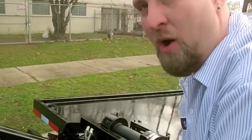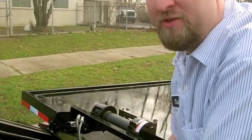You loosen the pulleys up, get the adjustment out of them, take the hoses right off. In an hour, you're done. Got both winch hoses changed, as opposed to about 8 hours.